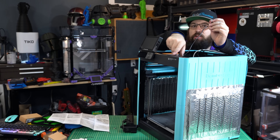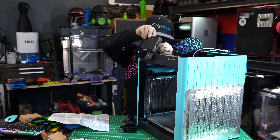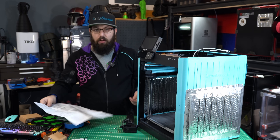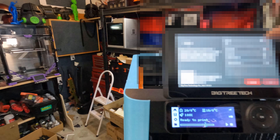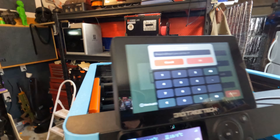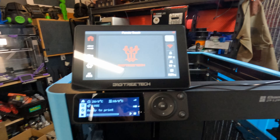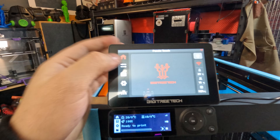That plugs into the USB-C port on the printer. There are some wire management runs built into the frame, so run the wire up through that one hole in the front and plug it in. Make sure it's set for DC 5 volt and that is it. Now I guess we turn it on. First it's going to have us connect to the network — I'll blur all this. Then put your printer name — we're going to call this P1P. It does ask for a bunch of information like wifi info, printer serial number, and access code. You can find all that on the screen, but we've got it installed and we've got temperatures showing as connected.